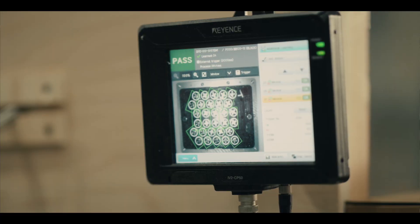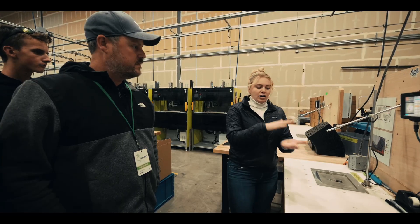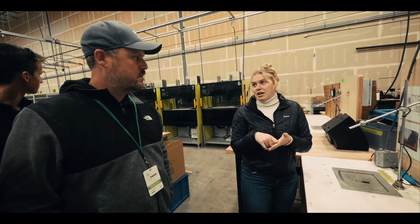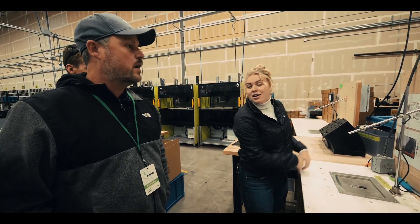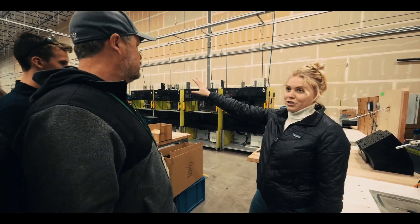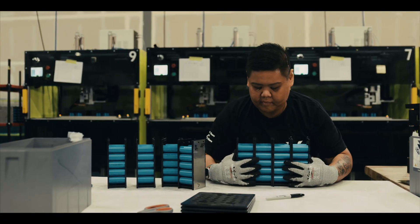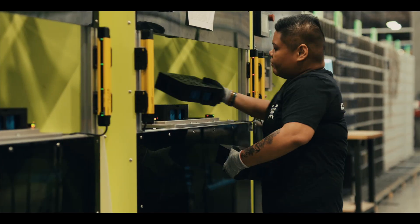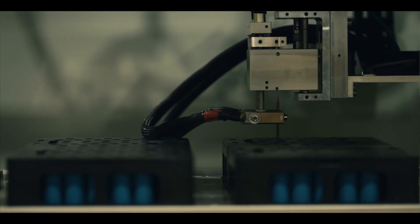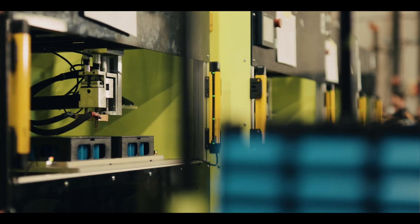So it'll say pass or fail. Once it passes, the individual working this section — we have a nickel sheet of plating on each side of that mod pack — they're going to sign it and date it and say it's good to go. So we have a QC process basically from every step of the way until that battery is completely closed. Once it passes, we move it on to these machines right here, which are called welders. This is going to spot weld that nickel plating to the cell itself three times on each cell simultaneously, bottom to top. Our engineers actually built these machines.